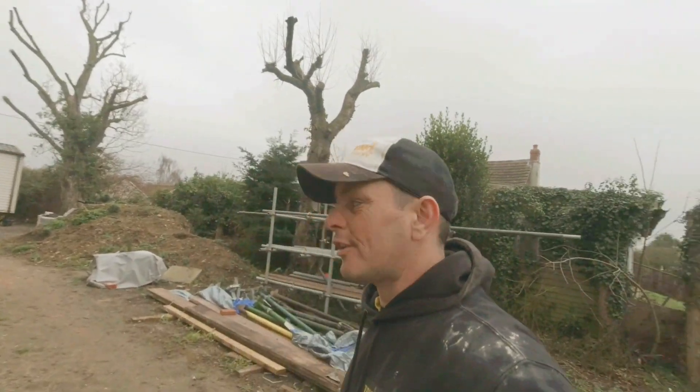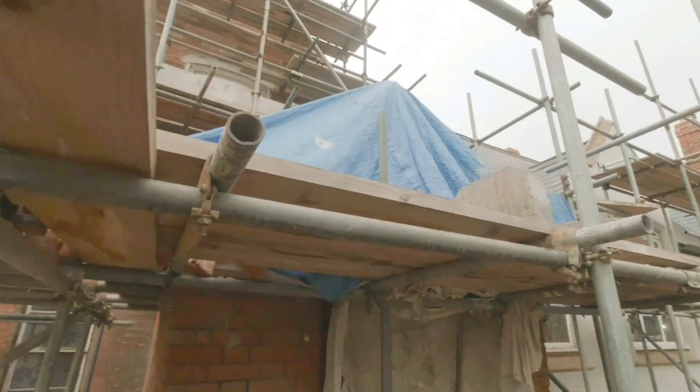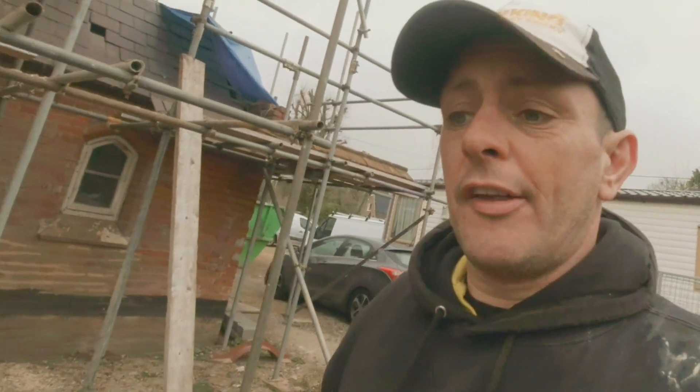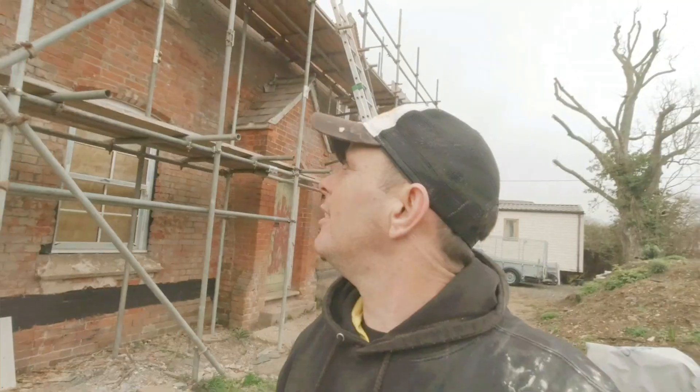That is five of the gables done so far, all coped right up to the top. We still have another full gable to do here, and he's going to source some more copings so we've got enough. At the moment we want to keep them all the same at the front of the property, and we've got enough here on this scaffold to do this gable — but that needs to be roofed first. We have this section here that comes from the kneeler and up the lead, to join where I did the others, so we've got those to do as well. We need this roofed first so we can get our lead on, then our coping goes over the top of the lead. So that's the next port of call, but for now that's this job complete until we get the new copings. Happy days.